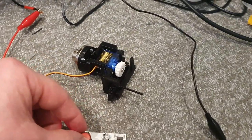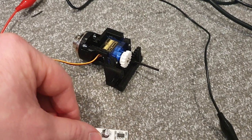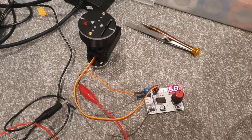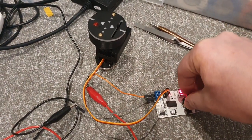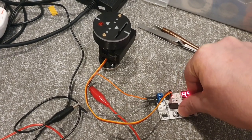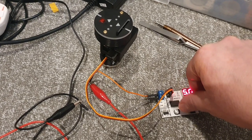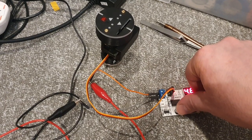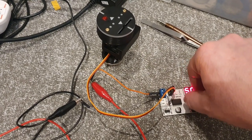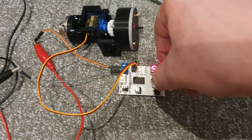So I took that design initially into the very centre disc and unit within this prototype. And again, we can see that in operation now. However, you can also see that the ratchet gear extends outward of the footprint of this centre unit. And whilst this protrusion wasn't massive, it was enough that later on, when you had all the other four items spinning around this central core, it did interfere with the movement of those. So what was therefore needed was a redesign of this where you achieve the same linear movement, but within the footprint itself.